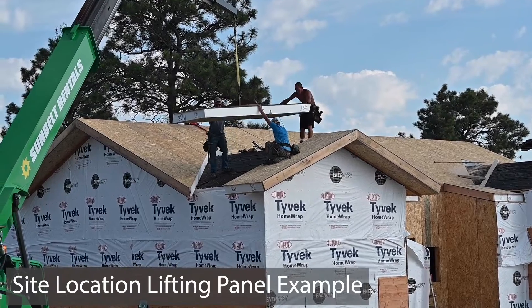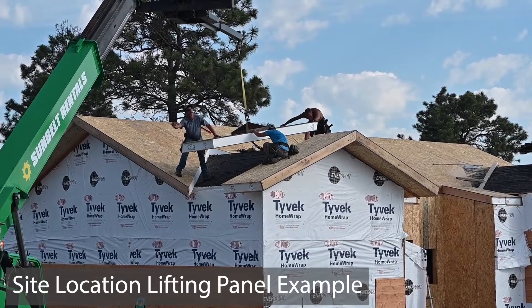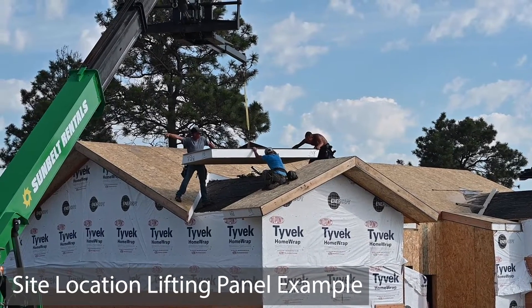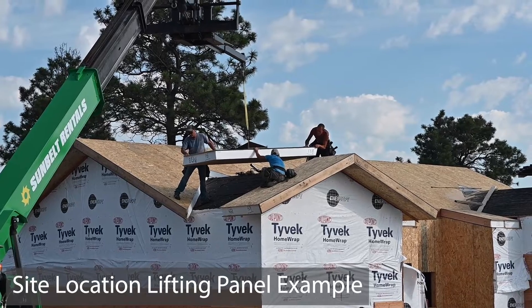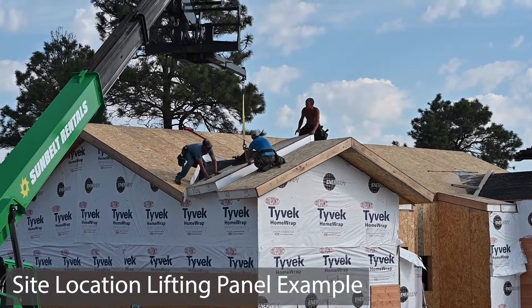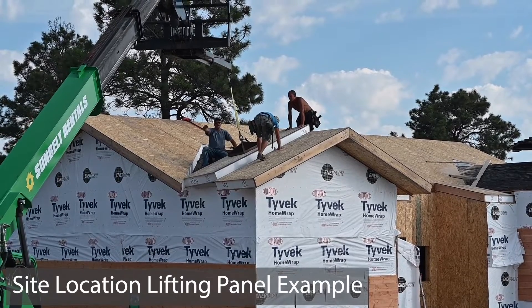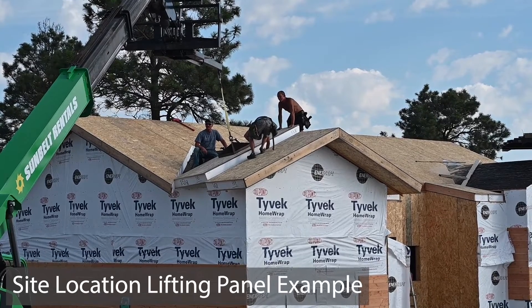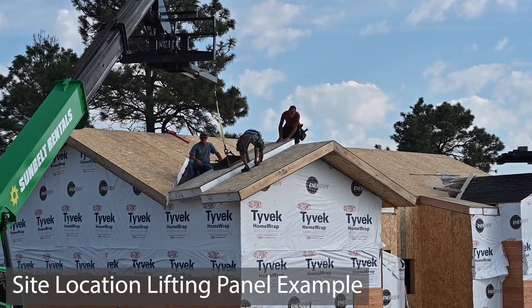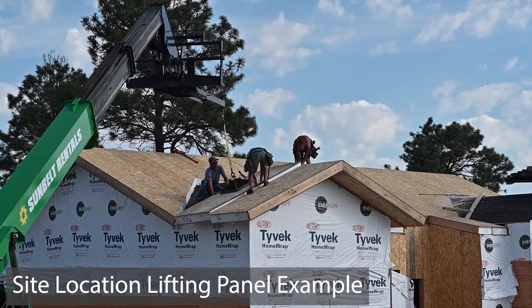As you watch the guys put the panel up, it took a fair amount of time. The first panel on every side always takes longer, because you're trying to get it positioned square to both the outside gable wall and the bottom eave wall. This particular panel is set up so we have a plumb cut bottom that flushes out with the wall itself, and the gable side is flush with the gable wall — so really the wall is just extending upward.